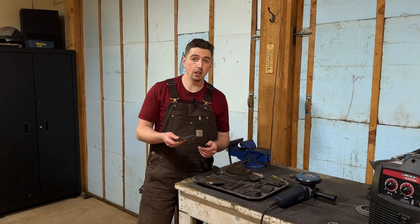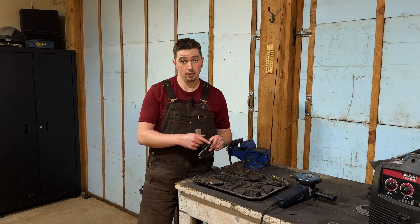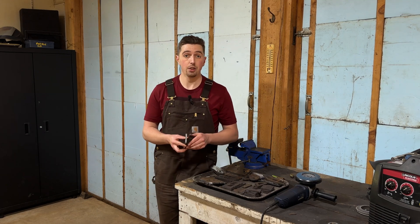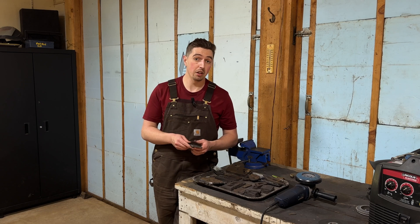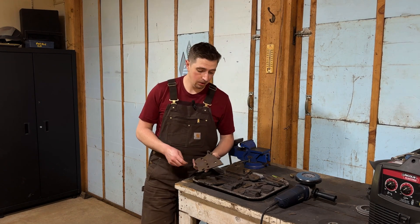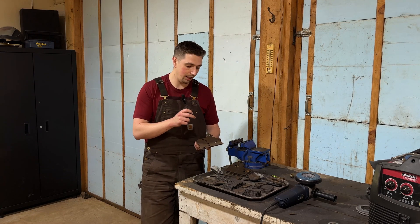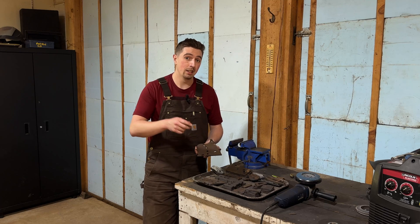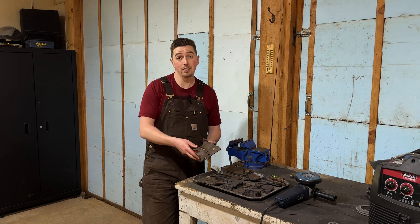Typically sheet metal comes with mill scale on it which can affect your weld quality, and when you run the plasma cutter there's some slag left behind. So I am going to be processing these a little bit prior to welding to try to achieve the best quality weld possible without any contaminants. We do have to run the cutoff wheel — we are going to grind through this, pun intended — and we have a lot of fun work ahead of us. Let's throw on a respirator, throw on a face shield, and rally this out.